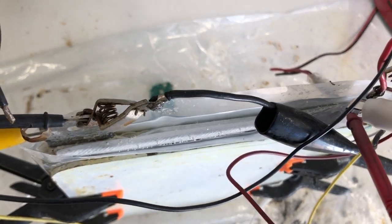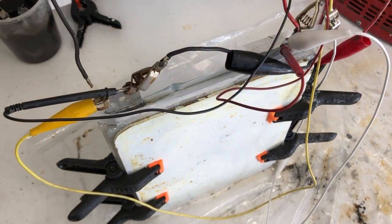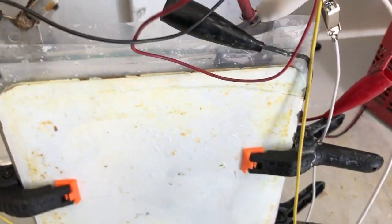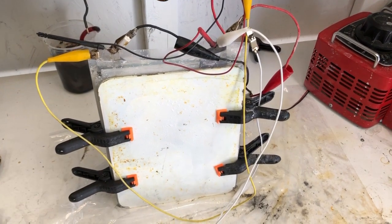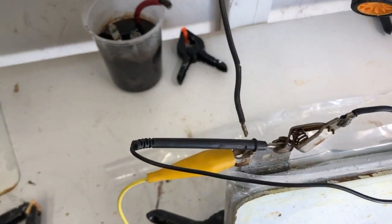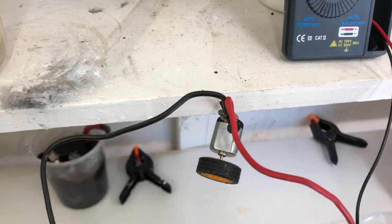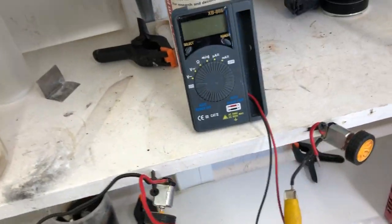Anyhow, this is the jewel. This has an aluminum plate and a membrane separator, and then a piece of cardboard with a few interesting doping chemicals on it. This is a waterproof type of cardboard. The electrolyte in here is the concoction, but it's dirt cheap. This is a single cell battery — it's about six by seven inches — and the power we're getting out of this battery is phenomenal. In a car battery, or when we put this into production, it will have probably 60 plates together.